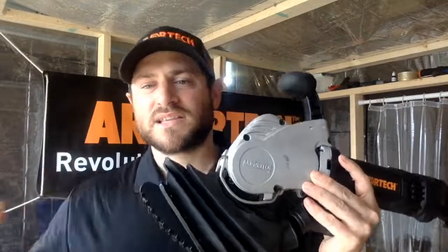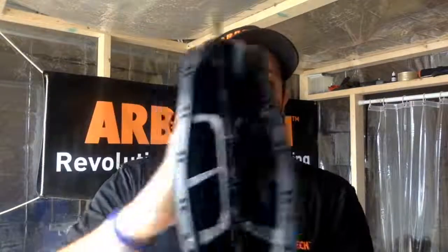There are going to be fine particles in the air, but one of the other beauties in terms of dust with our AS175 unit is that this is mainly designed to release chips and sediment. It takes out big chunks of concrete. It doesn't turn this into a fine dust like a grinder or a spinning disc that's going to be working on your normal mortar. This is physically going to be working in an oscillating motion. You can see the two blades here on the front, and how they work is they rotate onto themselves, hitting into the brick at a slower speed than an actual grinder or a spinning disc.